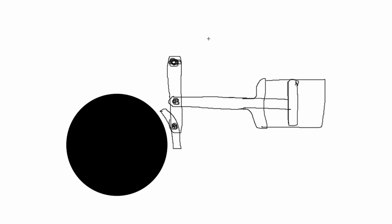Level one — very simple. We have a wheel, a brake shoe, a lever, and a piston rod. If we stick compressed air in here and press on this piston, it's going to push this rod, pivot this lever, and press this brake shoe against this wheel. The resulting friction will slow the train down. There you go — level one.